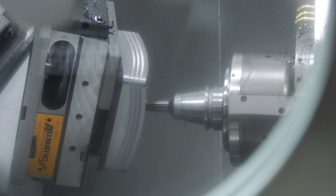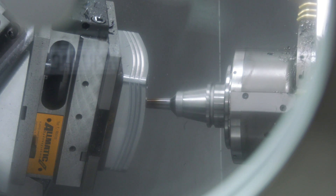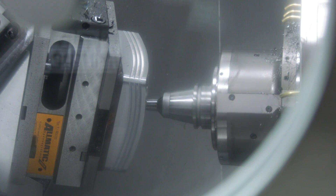With the horizontal spindle, do you lose any working envelope compared to the vertical configuration? We try to eliminate that by increasing the stroke in the Y-axis — we have an extended stroke of 900 millimeters there. With 650 millimeters in the X-axis, it's a little more stroke in the Y-axis to have fewer limitations on work pieces, even when swiveling the work piece through almost the entire working area.